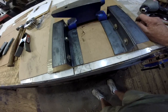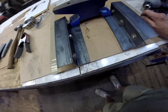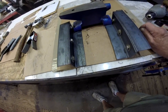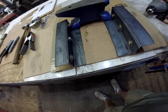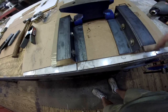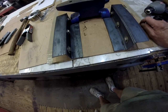That will be the hardest part of the whole build, because the only way I can cut that stainless is with a side grinder. But I can do it - I've done it before, cut pieces of it before, so it's not that bad, just a little time consuming. And I have to do all that outside, which means in the heat we're having in the Southland it will have to be done early, early in the morning - right at daylight, which I'm out here at daylight anyway. Then of course I'll go back and true everything up, sand, polish, get ready to paint. And then we will mount it on the boat and see what it looks like.